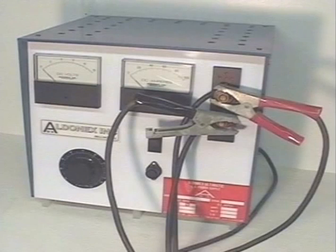There are many larger power supplies or rectifiers available, from 100 to 1,000 amps. These machines do a great job, but for the occasional chrome plating operation, their cost may be very prohibitive. A rule of thumb on pricing is to allow $1,000 for every 100 amps, so a 500 amp machine could cost around $5,000. The most effective, least expensive method of control is nichrome wire.